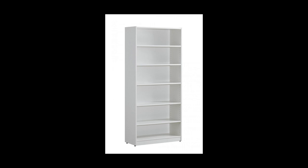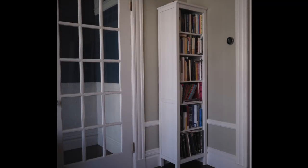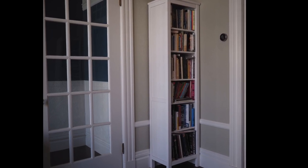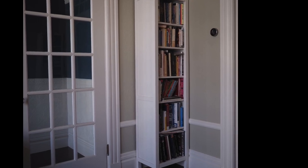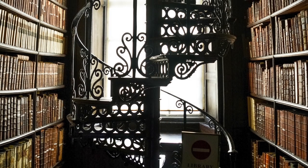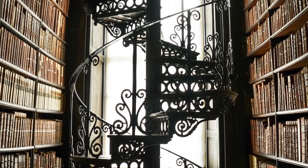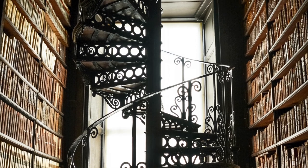There are some other design trade-offs to consider. How much space do your shelves have to span? In a stand-alone bookcase, it may be easier to shorten up the shelves by making the case narrower. But if you are producing a built-in bookcase, the shelf length is determined by the room space it has to fit into. Then we need to think about what type of aesthetics are important. Do you want a heavy-looking shelf? Maybe for your gothic dark wood library? Then even utilizing a 2-inch shelf stiffener is probably just fine.